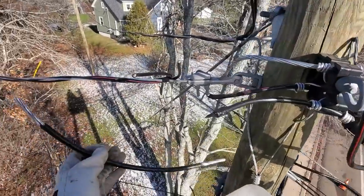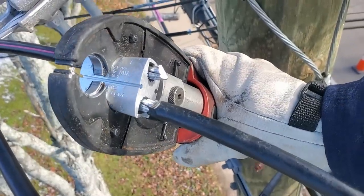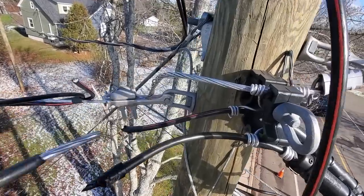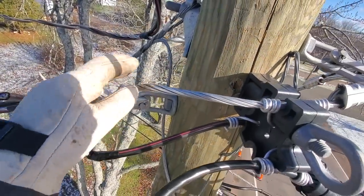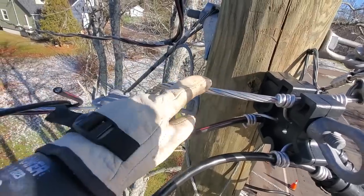Not a big deal. I've got a couple pieces of wire here ready to go — we're gonna crimp that on the dead side first, and then one at a time heat them up on the live side. The neutral is still intact, but you can see even on the neutral here, if for any reason I ever had to cut that neutral, it's not going back together without making two connections.